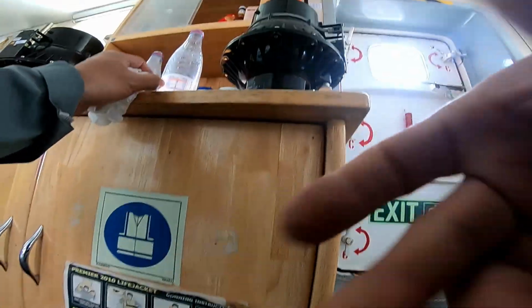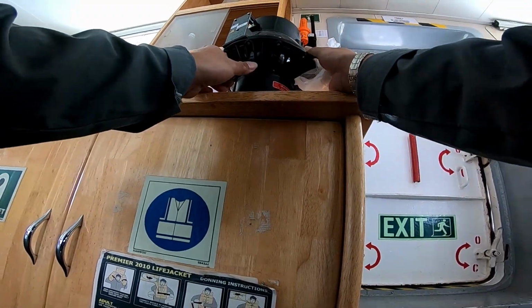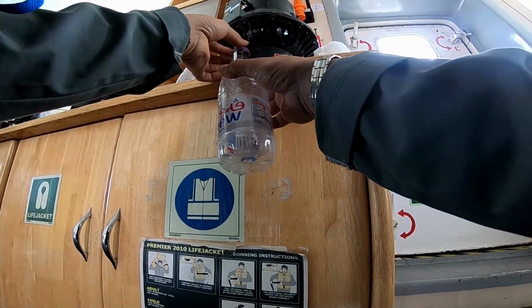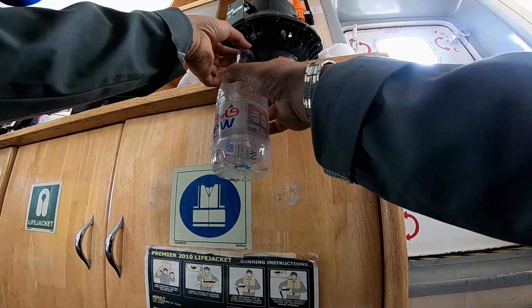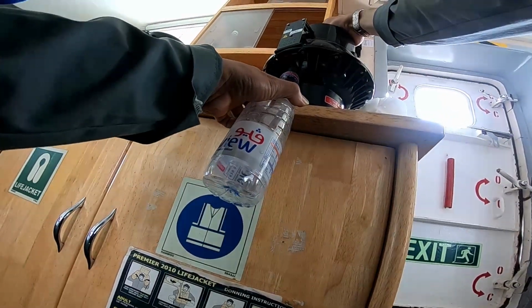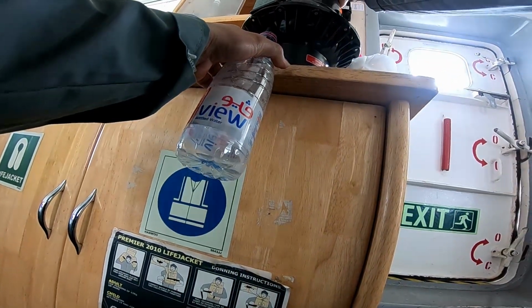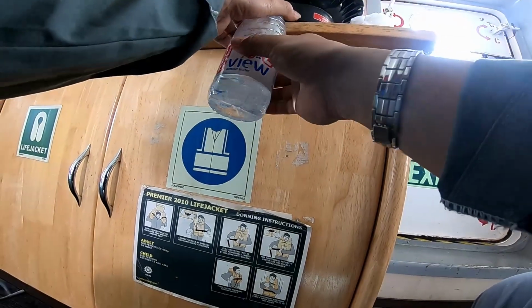Okay guys, what we will do, just drain this and change the water. Last time I did the service already for this and did the inspection inside the new gyro spare also. So what we will do, just change this water. Okay, you open this first down, drain it, and then open the cover on the top. Okay, cover here. So when you open the cover, pressure will release and water will go out. Okay.